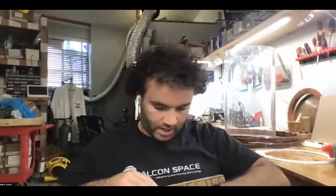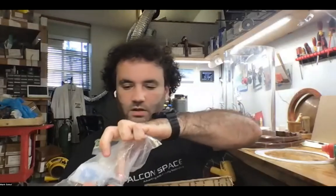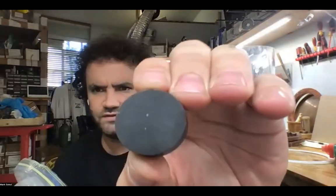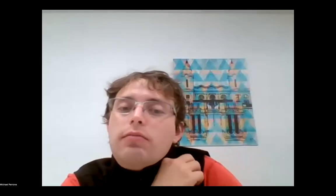How are you going to grind the superconductor faces flat when you get them? Well, we have some superconductors already that were made in Ukraine, I think, a while back. They are pretty flat already. We have a CNC too, so we could face it with the CNC. What we did was use a diamond wheel on a traveling standard surface grinder.